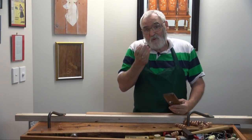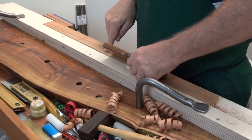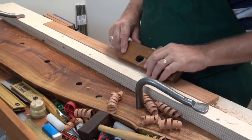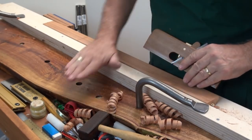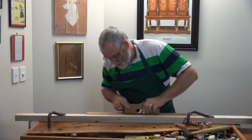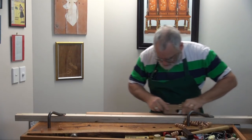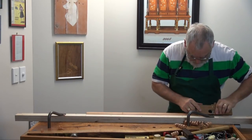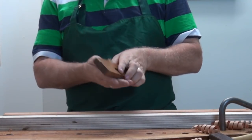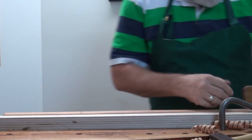With this I want the curve to be going uphill, so instead of starting at the back here like I did with the previous one, I'm actually going to turn the plane this way, which will take from here back. I don't want to flatten the plane totally from this angle to this — I want to keep it within that range, about a five degree range.